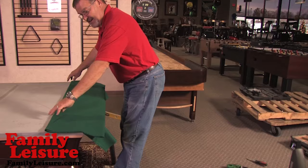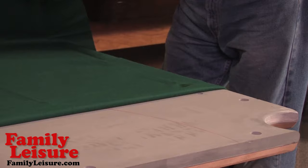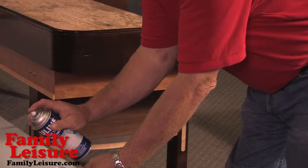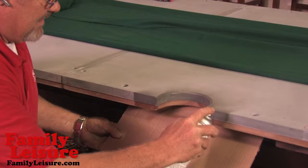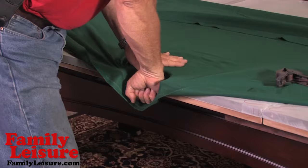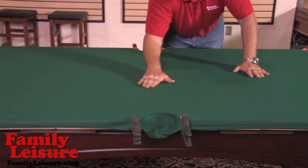Once the playing field is cleaned, the felt goes on the table. Make sure that the sticker side of the felt cloth is placed up. Stretch across the table evenly. Fold lengthwise into thirds across the length of the table towards the middle. Do not reposition the cloth. You will need a fast tack adhesive to adhere the felt to the slate. Apply adhesive to the middle of the end piece of the slate first — do this at both ends and pull the felt taut. Now apply the adhesive to the inside edge of the center pocket as well as the playing surface of the pocket. Now the felt is moved from the middle of the table to the original position around the center pocket. Smooth out any wrinkles and clamp down. Now the process moves to the corner pocket areas of the table — be sure to smooth out any wrinkles at this time.